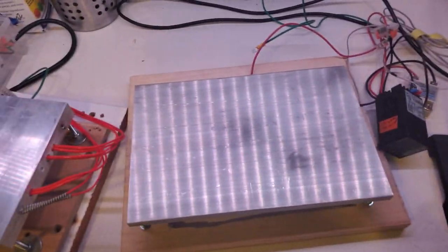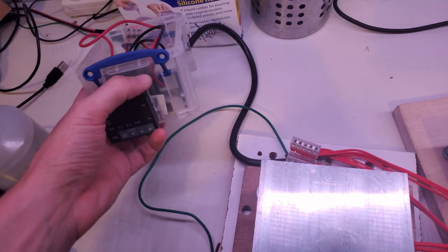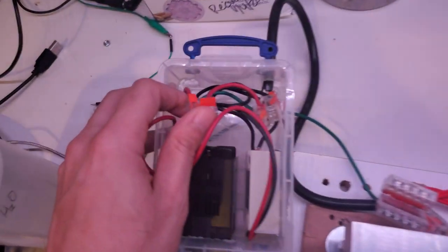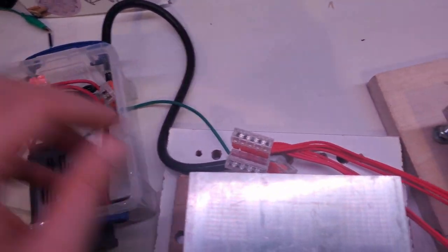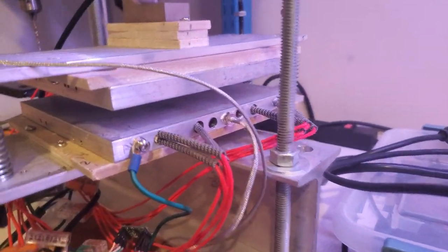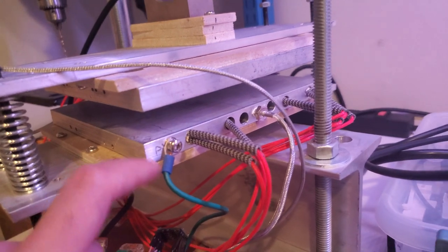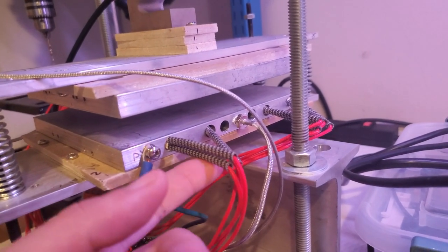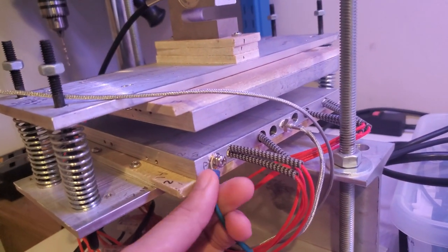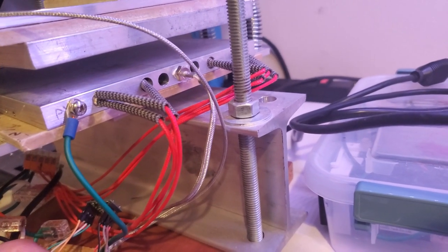For an enclosure I use a 'Really Useful Box,' cutting a hole with a hot knife, dremel, or saw to pack all the wiring inside. WAGO connectors make hooking up wires much easier. There are times you'd choose one design over another — for my heated hydraulic press I couldn't use PTC heaters underneath since the plates are being compressed, so I used the cartridge heater design instead. Do make sure you have a grounding wire connected for safety; consult the wiring diagram linked in the video.